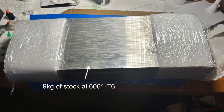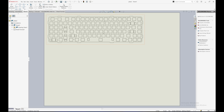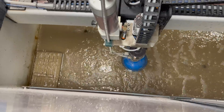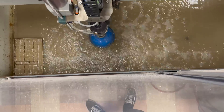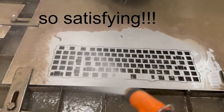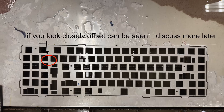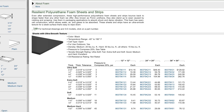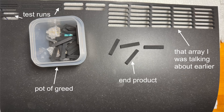Fabrication was a lot more complex than I initially envisioned. I decided to CNC machine the case out of aluminum and the plate out of stainless steel. My go-to reaction was to laser cut it, but this didn't work out as the heat and material removal released internal stresses and warped the part badly. I then turned to the waterjet and got a good part, however at about 90% through the operation the waterjet clogged, and the cut resumed about 1mm offset from where it should have been. I also laser cut the foam inserts on a CO2 laser — surprisingly easy.